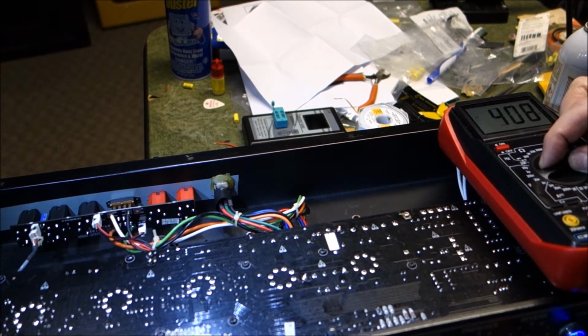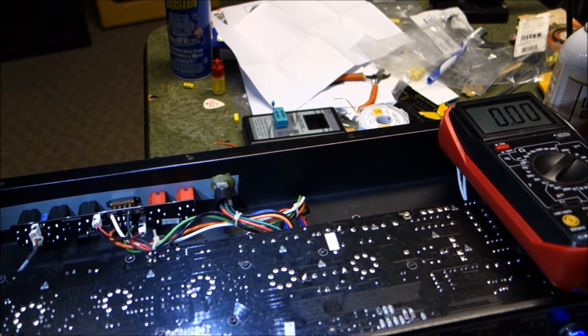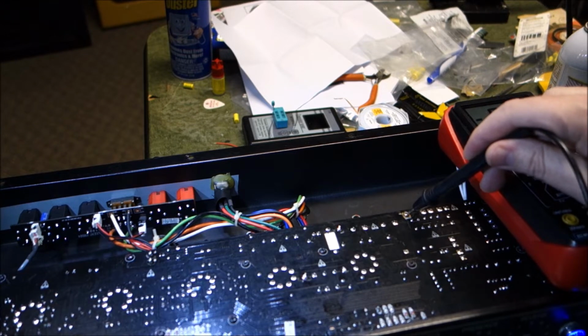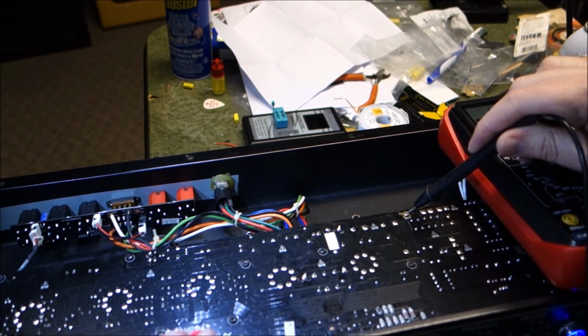I would think that it would be a pretty low voltage module. So we'll set our meter to 20 volts DC. This is allegedly the chassis ground point right there. So we can go there and then we can kind of walk around on the pins. And of course the damn tripod's right in my way. Let's see if we can go underneath it here.